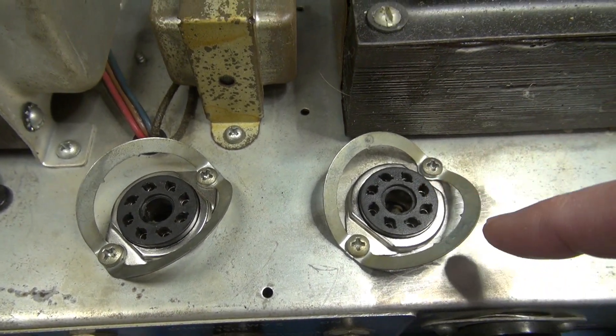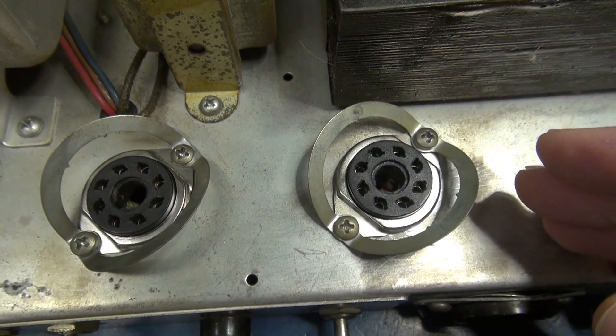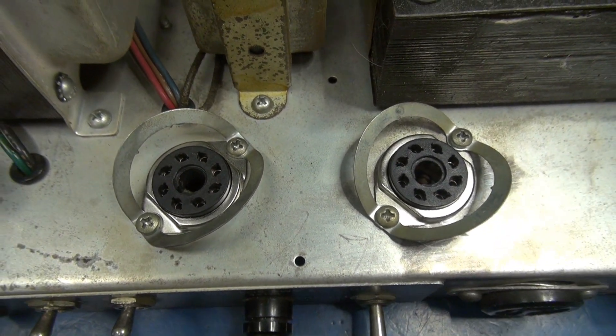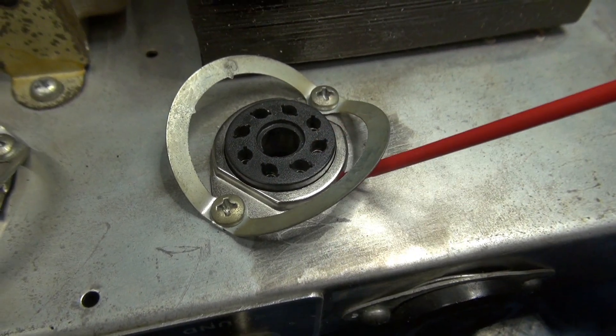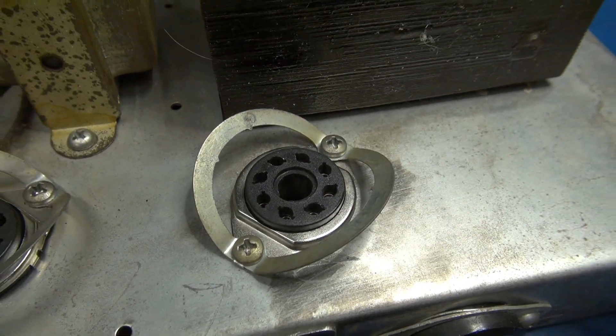This is not Bakelite and the pins internal to these sockets are low quality and they lose their retaining force very quickly. Here's a close-up on the Chinese socket. You'll see that the plastic is rough and that this base, pressed metal, is elevated as compared to a real one.